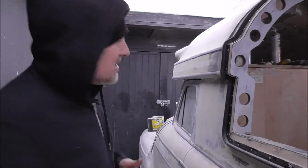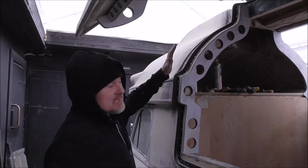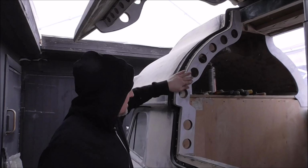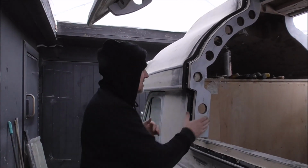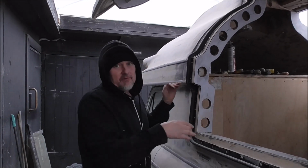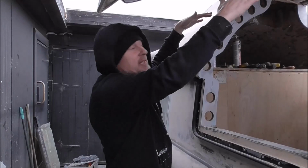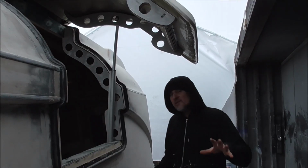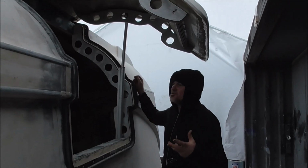So this week we've put these timbers in here, and this is 18mm plywood, and then I've laminated it in dye bond. So this is really strong, really rigid, and this is giving us that structural strength up into the arch of the roof. All this stuff we've done on here, this looks nice and totally structural.